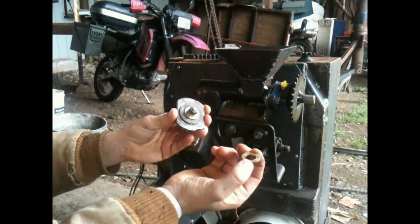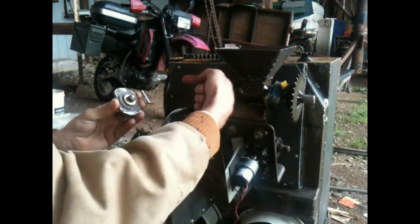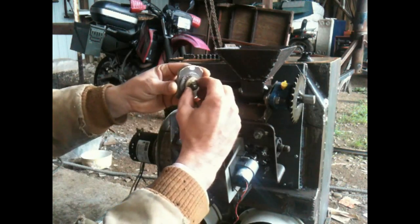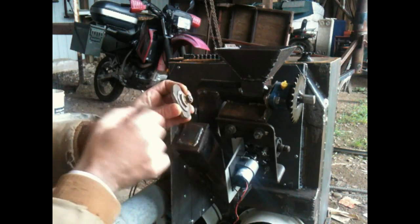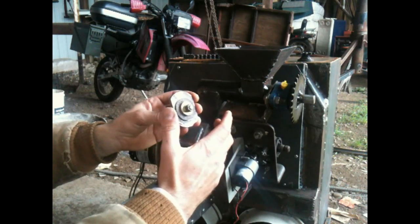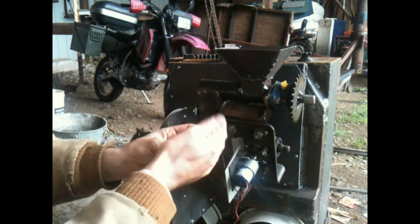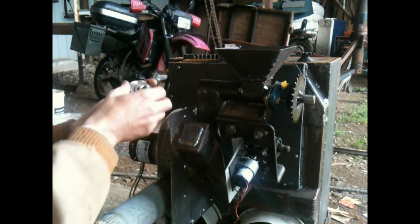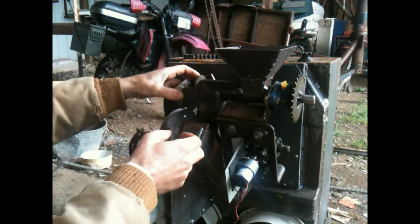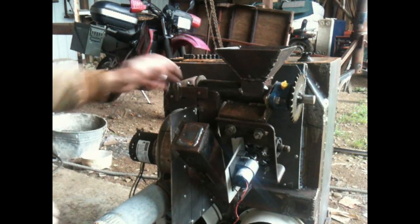Here we go — that's my copper washer, that's the brass fitting. The auger is fit on this and it's turning on the washer; it's not rubbing on the metal nut, it's rubbing on a copper piece. As soon as it's gonna wear out, you just open the bolt, put a new washer over here, put this one back.